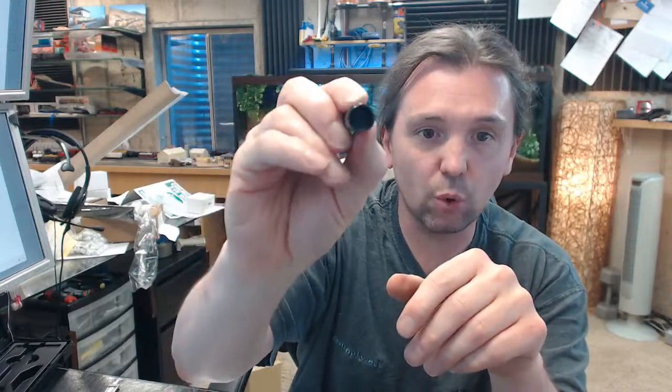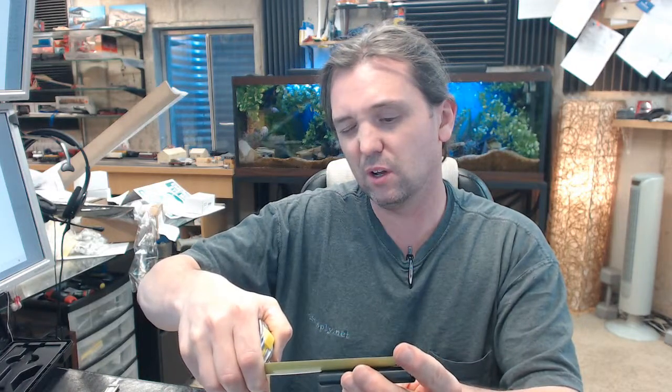It's got the keyed out area here, but most importantly what you've got here is this captive sort of hollowed out area. So if I'm in a position where I need to pull that plug through and pull my plug out and let top pins and springs come out, I can control the fact that they're going to fall into the end of the plug follower and then I can control that material and not lose it, rather than it shooting out the back end if it was a hollow tube type plug follower. The SUT-1 has an overall length of 5 and 3 eighths.